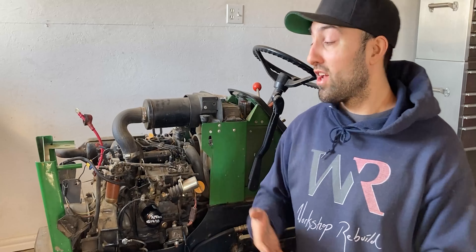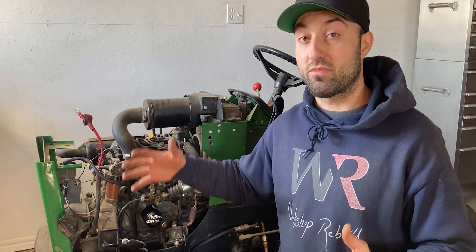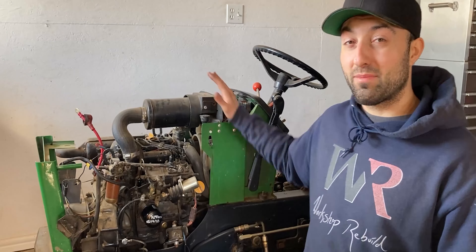I filled up this engine with 15W40 diesel engine oil — it works really well during colder winter days or warm summer days, so if that's something you want to use for your John Deere 332 it should work just fine. The engine is really dusty because there's a lot of dust here in Alberta, so I'm going to clean it off with some soapy water and blow it off before I start it up. I also want to drain about one liter of coolant because it's only rated at minus 20 degrees Celsius, and top it off with concentrate to bring it up to around minus 30 degrees Celsius.